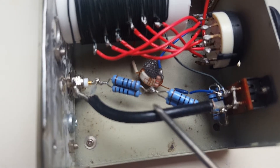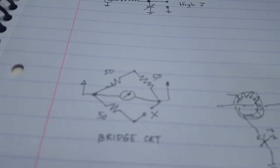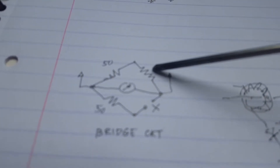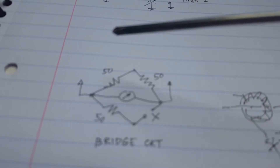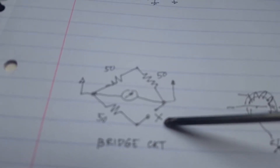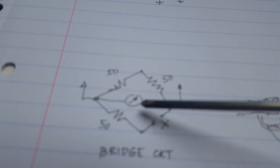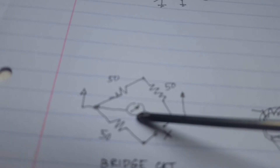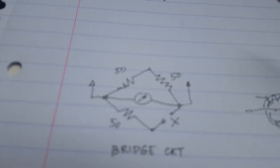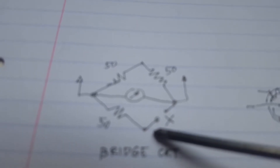On the other side you can find a bridge circuit. In a bridge circuit you have three known resistances — this is 50 ohms — and X is the antenna impedance. In theory, if all resistors are equal, no current should be flowing in the middle circuit. As you adjust the inductance and capacitance and approach 50 ohms, the current in the middle approaches almost zero.